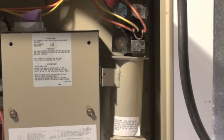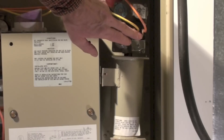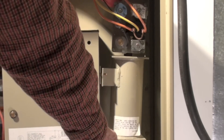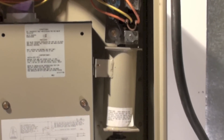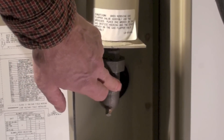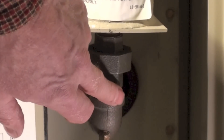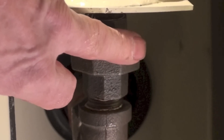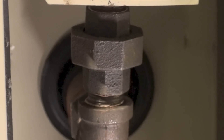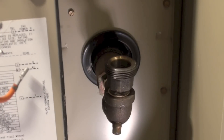In this one we're going to talk about the gas flapper. Here's your gas valve, there's this drum, and the gas flapper is right down here inside. I'm going to pull this gas valve off and pull this fitting off, and we'll take a look at the flapper and see if we can look at the orifice.